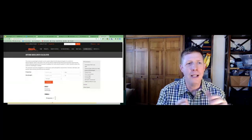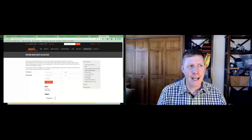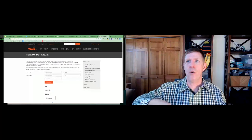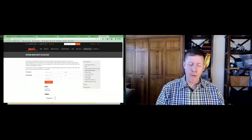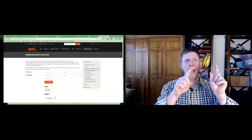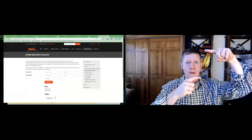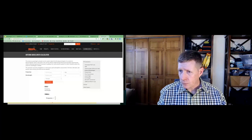Okay. And it's really, if you think about this, there's the speed of light, and RF electromagnetic pulses travel at the speed of light, and they have a frequency. So if you take the speed of light and divide it by the frequency, it will tell you how far that electromagnetic pulse travels in one of those cycles. And if your antenna is the same length as that cycle, then you're basically more in tune with that signal.